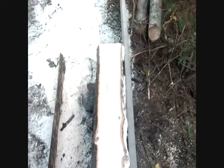So once you've got a cut like that on both sides, you just take your 2x4, nail it along here, 2x4, 2x6, whatever you're using, and then you can do 2 cuts along the side. So depending what the cost of a 2x4 is in your area, say for about $15 plus 2 nails, you've made something that you can run your chainsaw along to cut logs into timbers.